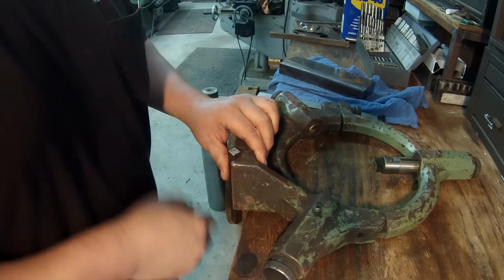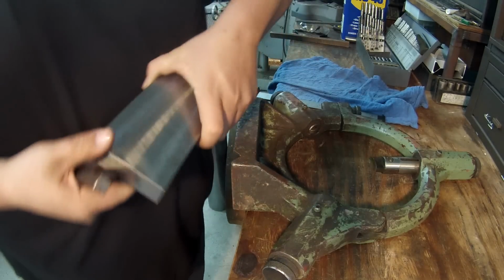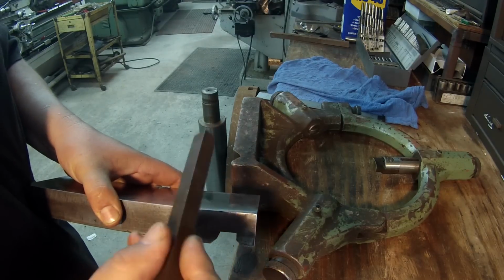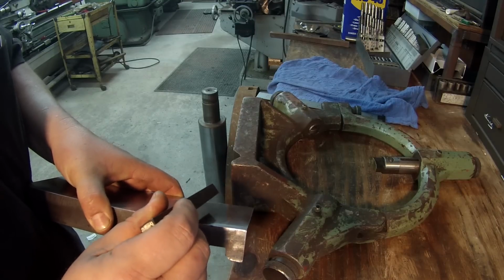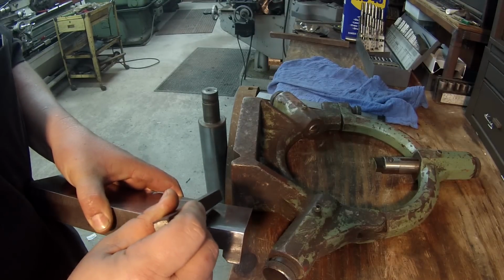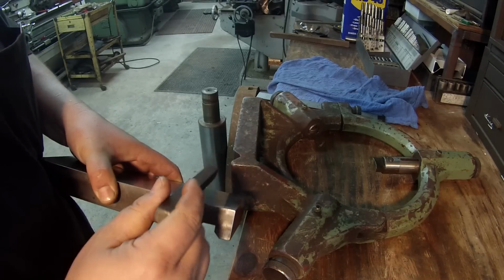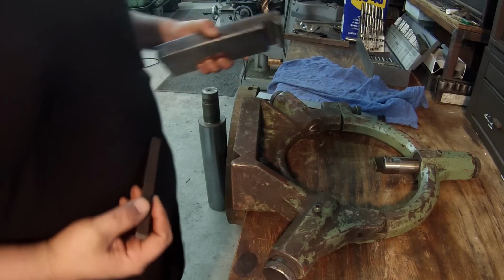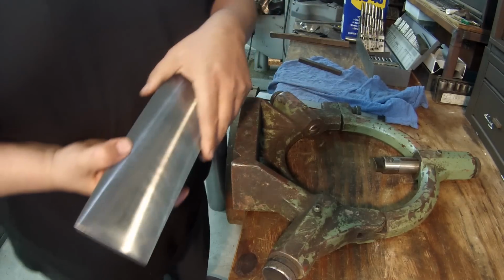So I'm going to do that, and we'll mill a notch wherever this is supposed to be in here for this to sit in there also, okay? And then we're going to hand fit it so that I can set the key in there and set the steady rest on it so that it's all sitting flat, and then the steady rest will be nice and square in there. All right, and while we're in the mill, we're going to go ahead and put our hole in there.